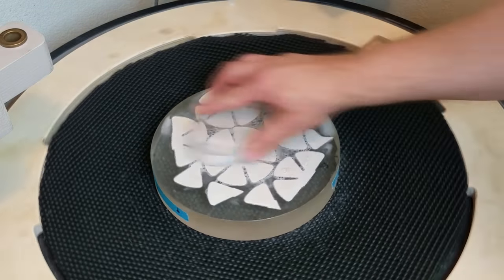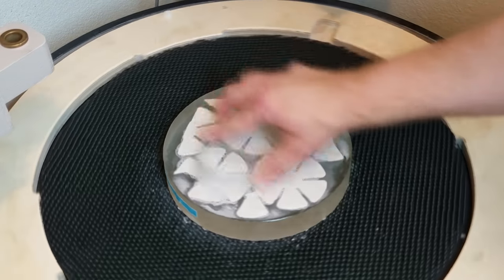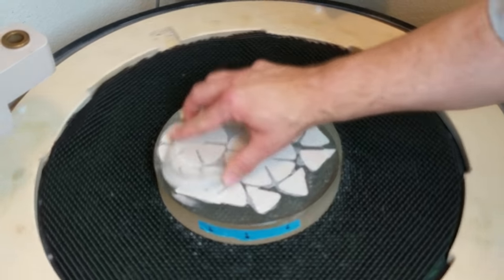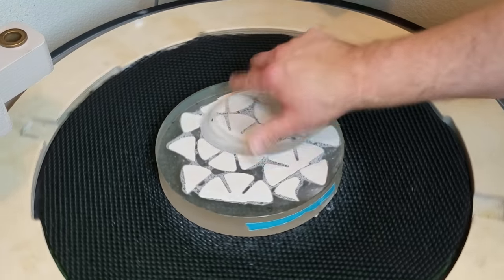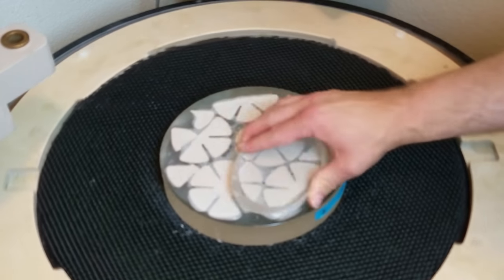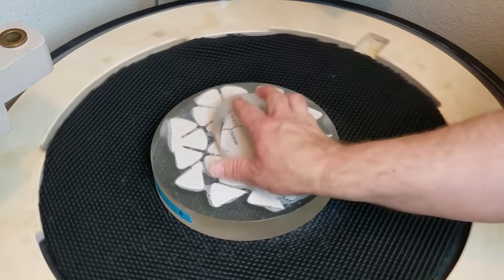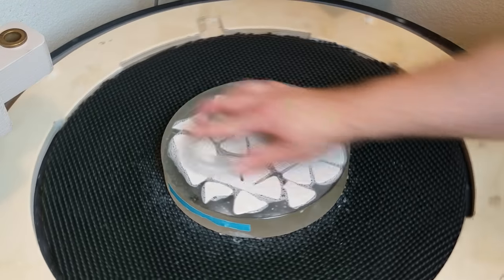You'll be surprised — in just 20 or 30 minutes of hand work you'll probably have the back of this mirror clear enough for our purposes. I'm working this on the pads, making sure all the pads are down so they don't come up or catch an edge. As I'm polishing, I stroke in every direction and keep rotating the mirror in my hand — do some strokes, rotate it, do some strokes.